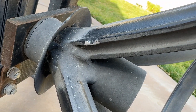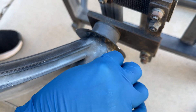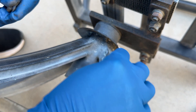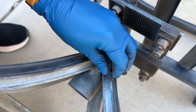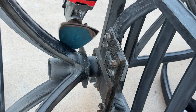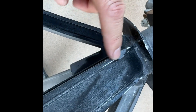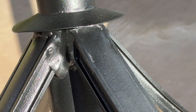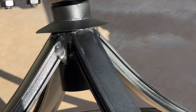Here's another project — part of the chair. Again, it was aluminum. Something had fallen on it and bent the aluminum, so I'm going to grab some of the steel stick and use it as a filler for this chair. In this specific case, I need to make sure that I'm putting a little extra so that once I sand it down it ends up looking flat. More than an hour later, I can go ahead and sand the piece down. You want to make sure that it is very flat. Once I sanded everything down, it looks flat and ready to be painted. This is the end result — this is how it looks once it was painted. This is the before, and here's the after — great results.